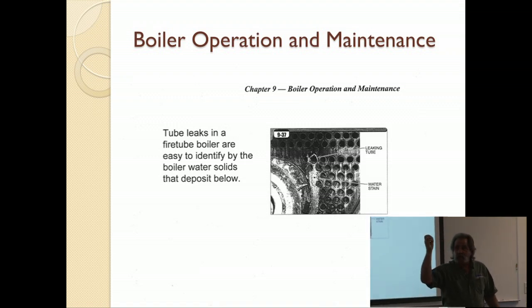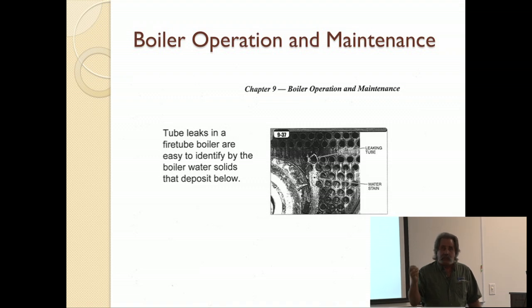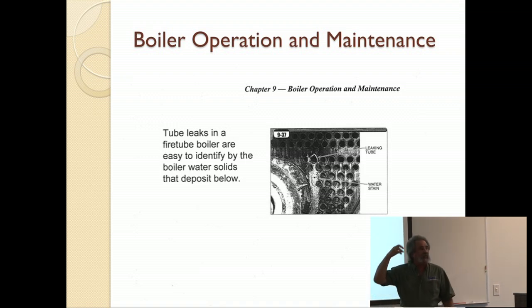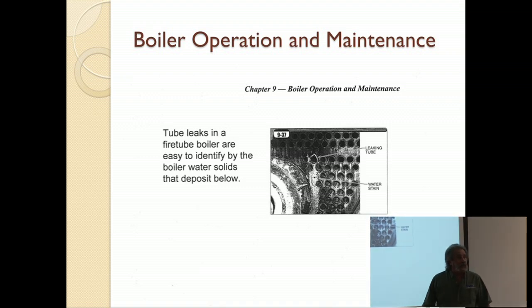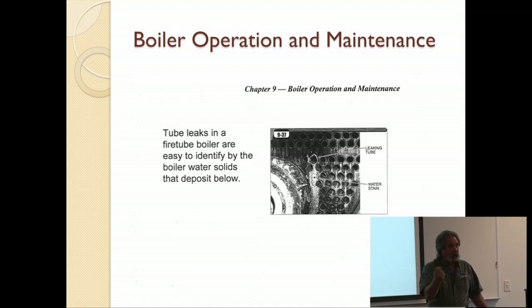When you condense that, as I mentioned before, one of the problems is if you don't keep that temperature up, and there's no way to do this except keep the boiler on very low flame, as low as you can during the warm-up period. All of them do it. But once it's done, you don't want to see that continue. You don't want to see it perpetuate, because this is the kind of crap that happens. You wind up with solids in the airstream that are precipitated out, and then they start grabbing a hold, rusting, scaling, and breaking.